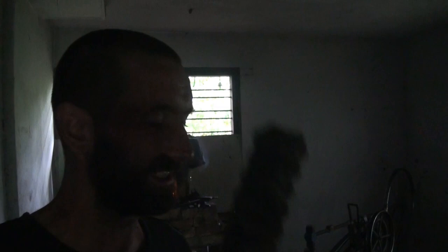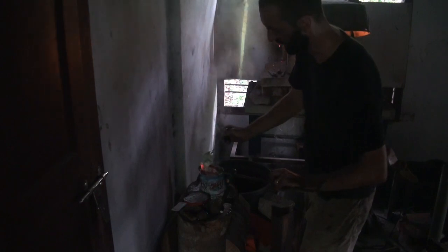Let's get started and see where it takes us — I'm going to start forge welding this now. I'm going to do the same process but be even more careful this time. There's more flux. There are a lot of holes in there and I need to forge weld it together gently, get it all to stick and get so much rust out. It's going to be really stinky. I'll put it into the fire to one side so it can cook a little bit without getting too hot — that should clean everything up nicely.